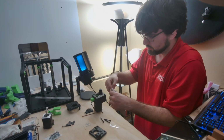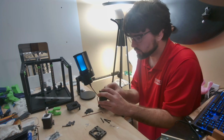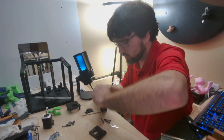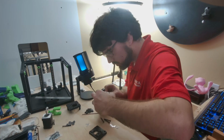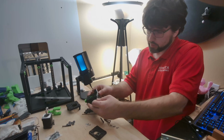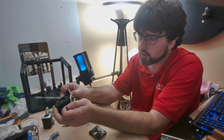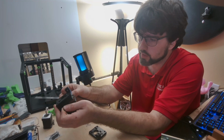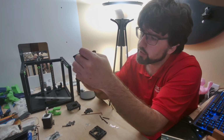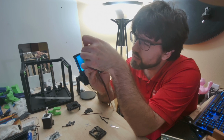It is a little hard to tell. One thing you can do is pull out the belt. Feed your belt in there, then pull it side to side, and then you can kind of move it back and forth and see where that belt is actually going to be centered, and make sure you are within center there on your drive.